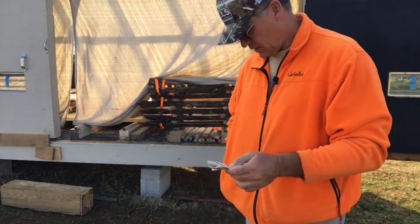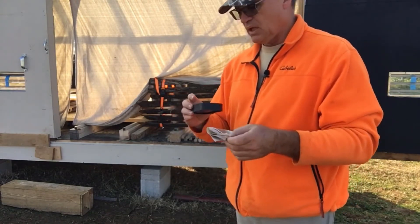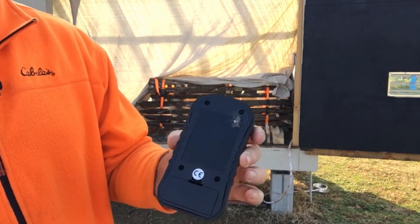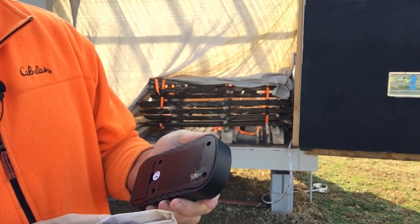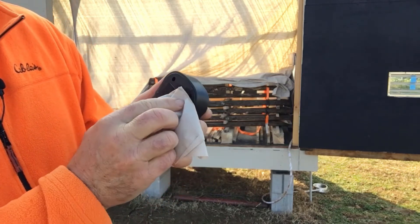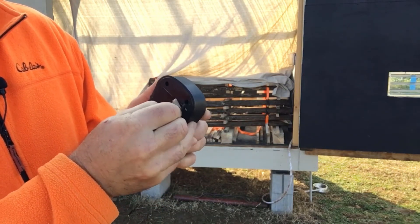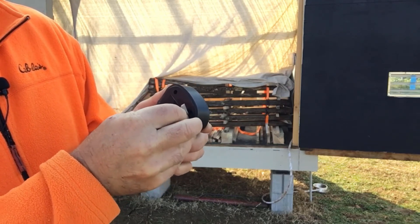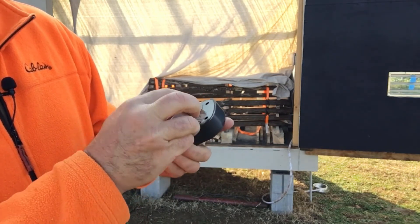I'm back with a napkin with WD-40 on it. You can see where I hit that pile of pitch when checking the moisture of the maple board under the pine board. If you get pitch on your hands, spray them with WD-40, put a lot on there, and it comes right off. These moisture meters aren't cheap — looking at around four hundred dollars for this one.